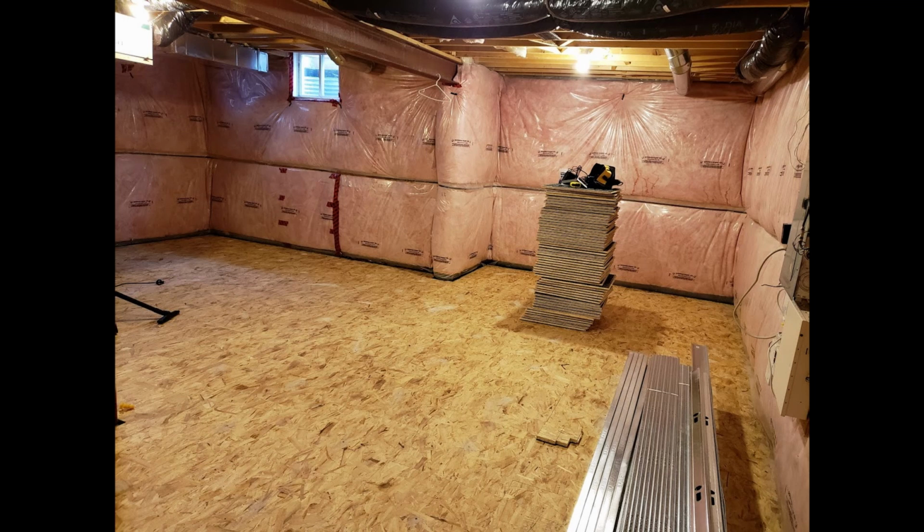But yeah, it's a great product, very DIY friendly. The reason I like it in 2x2 is if you have a small basement and you have trouble getting access, you can just carry it in a stack at a time. You don't have to have this big roll and think about getting sheets of plywood down. Over the years that I've done this, the first subfloors I was doing were 2x4s on the flat on the floor, screwed down with insulation taped in between and then plywood up on top. It was very, very labor intensive.